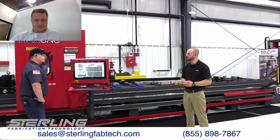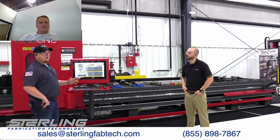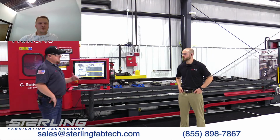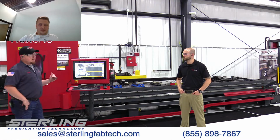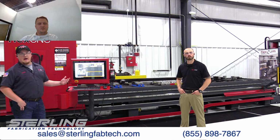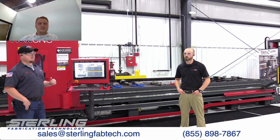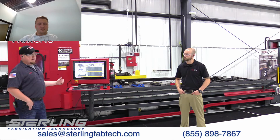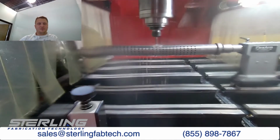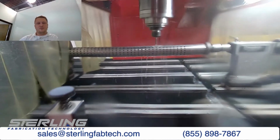Pretty good. It looks like we just got a couple rows left. But I do want to mention something else, to take off what Jason was saying as far as different applications that the tube lasers are good for. Something with the FlexCNC that not a lot of people might think about is, if you're using a tube laser and you have to tap those holes after the laser cuts it out, now that hole is pre-hardened before you have to tap it. Whereas if we throw it on the fourth axis and drill it, let's say flow drilling, we could flow drill the holes on the FlexCNC using the fourth axis, where the workpiece is not going to be hardened, and we can come in and tap it with no problem.